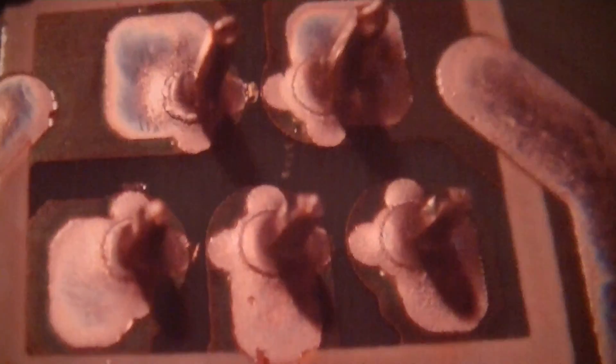These are actual pictures taken by me of boards that have been sent to me. You can see that crack there — it's on its way to going 360. There's one here too. On this IC, IC 204, which operates the convergence ICs, all five of these legs have cold solder joints, especially the most prominent one.